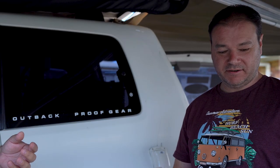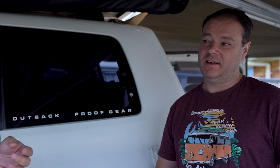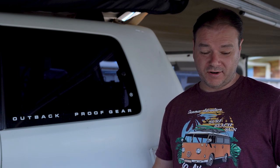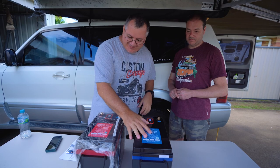You actually quality check each battery individually. If one's not up to par — not performing at least at 100% of its rated capacity — you pull it apart, see what's going on, and fix it. So you're pretty well guaranteed that when you purchase a PowerPool Australia battery, you are getting what you're paying for. For example, this one here is 286 amp-hours, and the Mercury here is 337 amp-hours. We make sure the numbers are the same across at least two full discharge tests in our workshop.